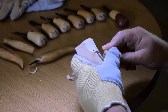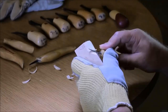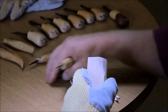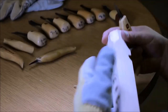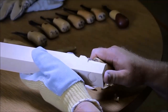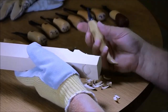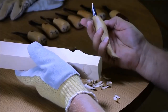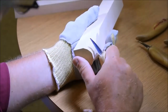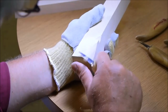The other thing that people do a lot is what's known as a paring cut. And the paring cut is such that a lot of people use it for cleaning fruit or different things. One thing with the paring cut is the fact that your thumb is going to be below where the knife is coming off. And the way that FlexCut's handle is designed, you just sort of roll that knife right down. And you see, as long as you're keeping your thumb below where that knife is coming off, there's no way that you can then cut.